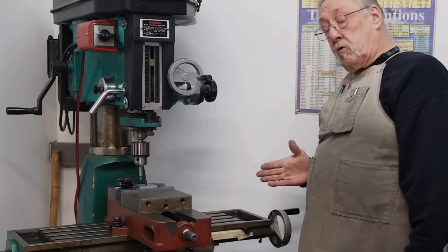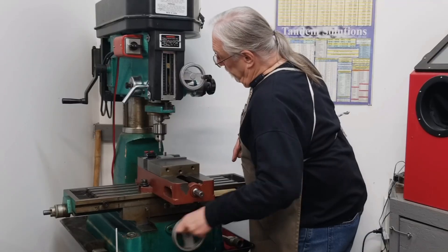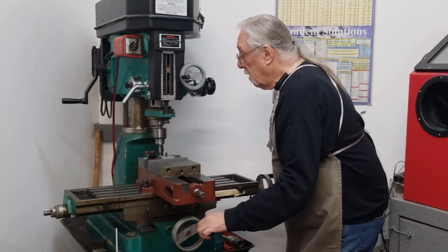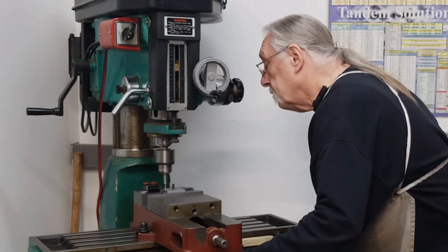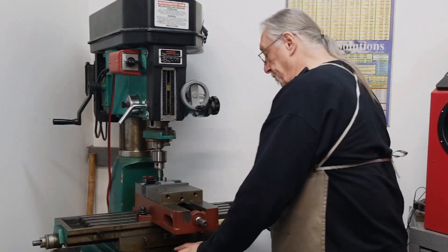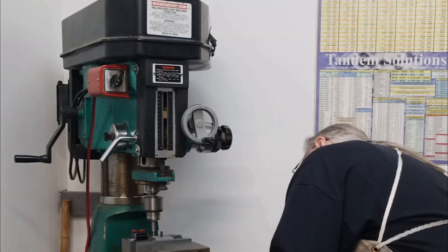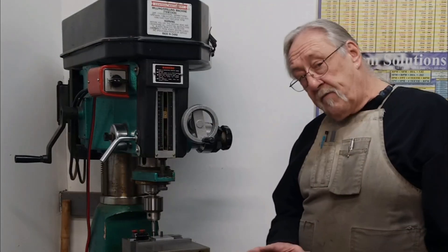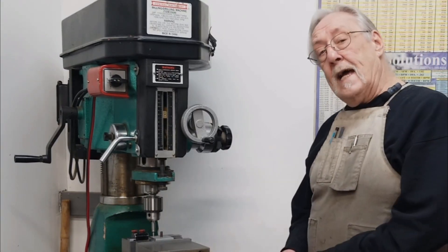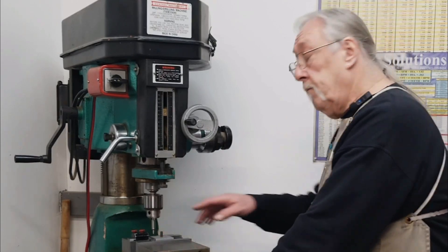And that's clockwise looking straight down your axes. Now we're going to go and do the y-axis. Turn on your spindle, thousand RPMs. It kicked out — set a zero. Back it off, start your spindle. Ten thousandths away, five thousandths away, and then inch up on it one thousandth at a time. When it kicks out, you reset your zero. Bring your spindle up and bring it in half your probe diameter — one hundred thousandths.